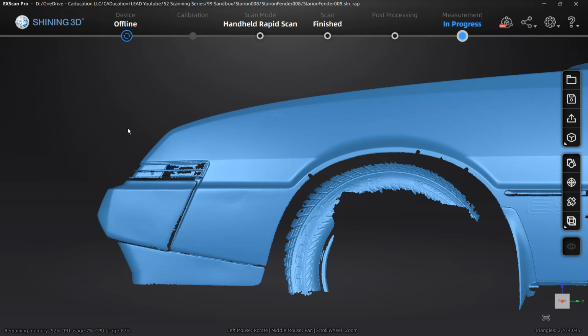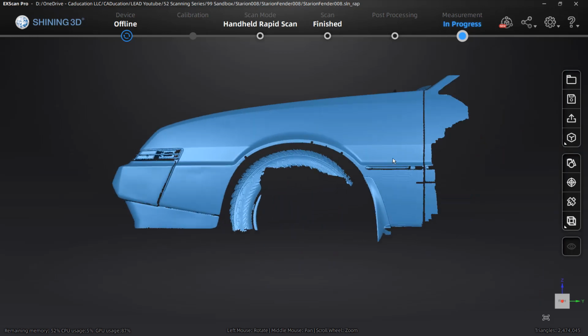As soon as we go to 3D print this, we'll be able to see if it fits the car, and hopefully that is going to fit pretty well. Once we get to the fiberglass stage, the fiberglass over a part this big really only needs to attach at this section of the car, and the rest of it can flex around a bit. But we need to think about those things when we're designing our parts.